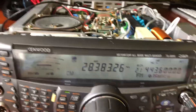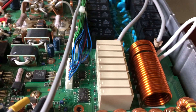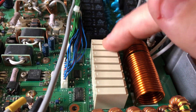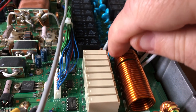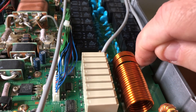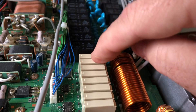I know it's not a bad coil — those don't go bad. You'd be able to see if one was bad. Odds are it's either this relay or this relay — one of these two is not closing. If I could get easier access, I could jumper from this side to here and that would tell me which one of the two it is.